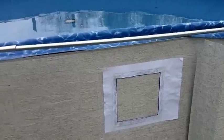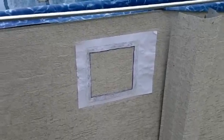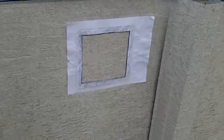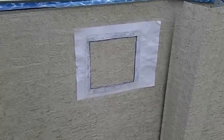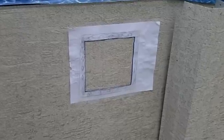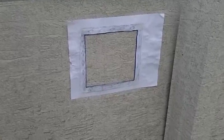I made a little template here — just a simple piece of paper and a pencil — taped it on top and skimmed over it. I'll be using it to cut the actual skimmer inlet, and I'll use the gasket to space my drill holes later. I removed my top rail and top rail anchor, pulled the liner back and pulled the top ring off. I measured down about three inches, which appears to be about what the other skimmer is set at, cut the hole out of my template, and traced on the inside with my Sharpie. That hole is now drawn.